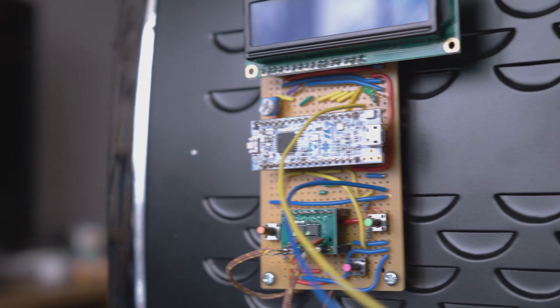You have to make sure you use high-temperature-friendly parts for pretty much everything in this design. You can't just rewire this with normal wire, because the coating on that wire is likely to get soft and move over time — and next thing you know you've got bare wires sitting at 120 or 240 volts depending on your country. Once I had the inside wired up, we just have to mount the controller, the switch, and something to get five volts to the outside of this toaster oven.